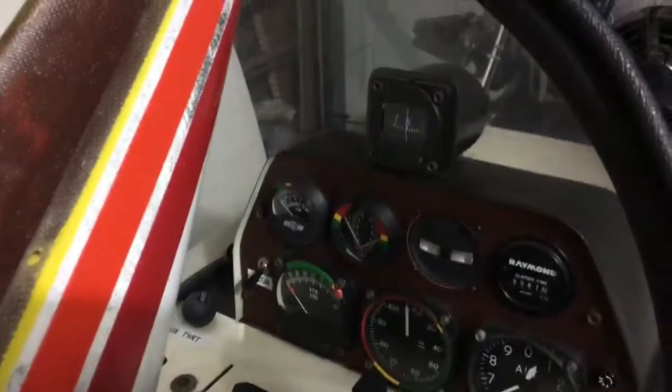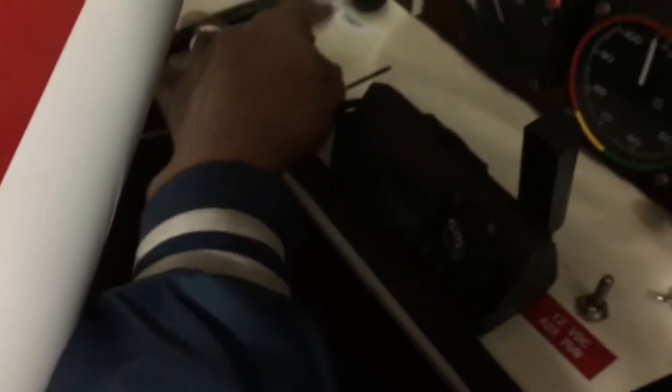You see, I have my GPS, my radio mount right here, a compass mounted on it, and full instrumentation, auxiliary throttle. I also have my choke. I moved it and made a lever right here. We can adjust my choke with this. It used to be up on the top, but I didn't have very much travel, so I moved it down here. I have an actual lever, and then you see my elevator trim down here.